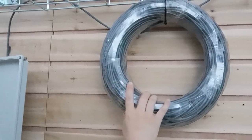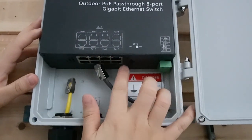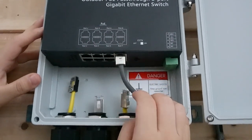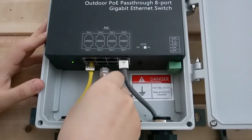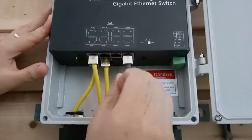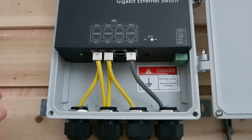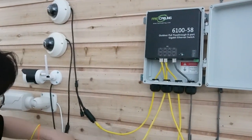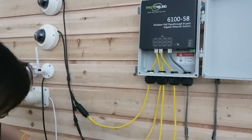Let's move over to the pass-through switch. This is the 328-feet cable. Here is the PoE pass-through switch. Remember, there are 8 ports, but only port number 8 is the power-in port. So I'm going to connect the ethernet cable into port 8. We can see the indicator lights are coming on — it's getting power and data. Since I'm connecting 4 IP cameras, I'm going to plug in 4 short patch cords for faster installation. Now I've plugged in 4 short patch cords. Let's connect them one by one — simply plug the cord into the IP cameras to get both data and power.